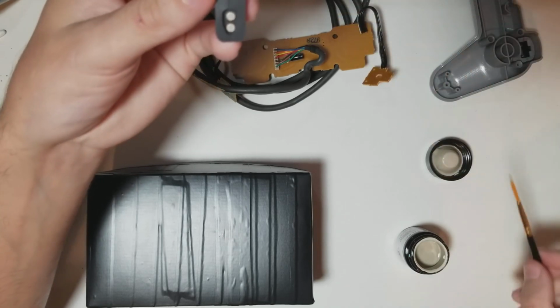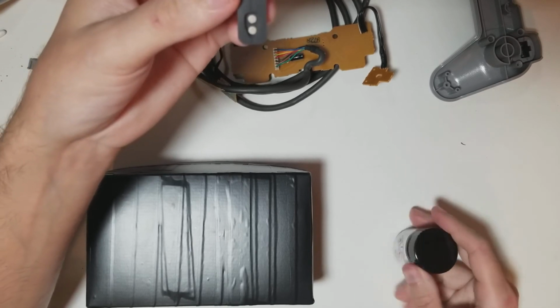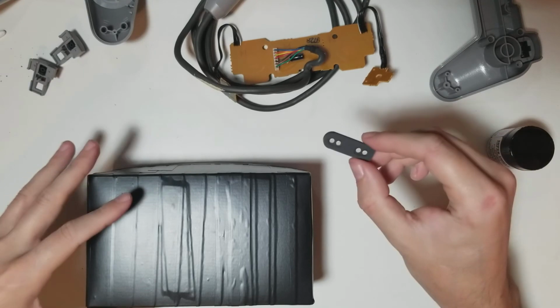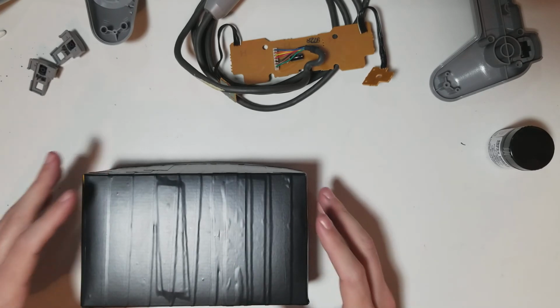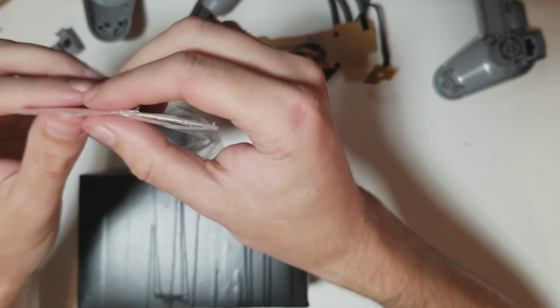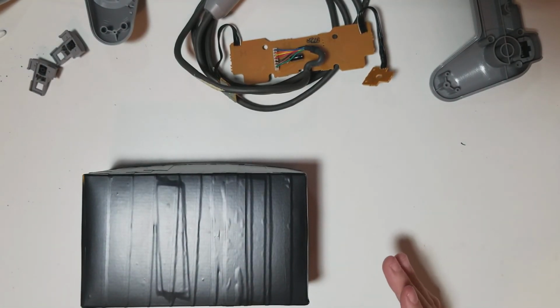And that's it. And as you can see, it's already trying to flash off, which, if you're unaware, the flash off time and the cure time are two different things. Flash off time could be 5 to 15 minutes, and that's basically when something like the acetone or the solvents flash off, and you can apply a second coat and it'll bond correctly. Cure time is when it's ready for the road, ready for use.